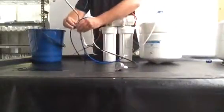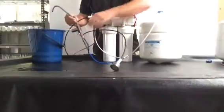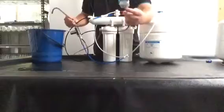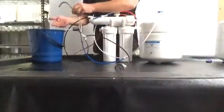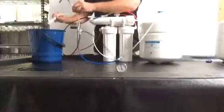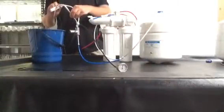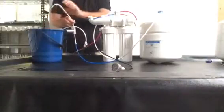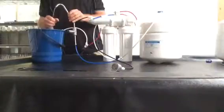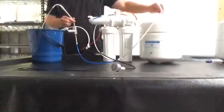The water filter tap is connected to the same connection as the tank. As soon as you open it you can probably hear the system kicking back in again, and you can see the pressure gauge reading. As you can see, this is a 100-gallon-per-day membrane that we put in our systems, so the waste-to-pure-water ratio is about the same. Some systems will put a lot more water to waste than this one. This is the reason we have a holding tank — you wouldn't want to be standing with a jug trying to fill it at that flow rate. But as soon as we turn the tank on, the flow rate becomes a lot stronger, just what you'd want to fill a jug of water.